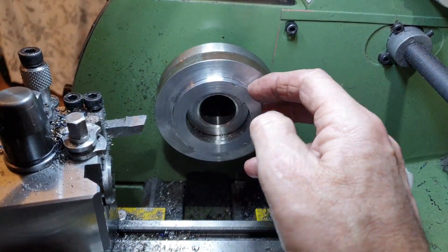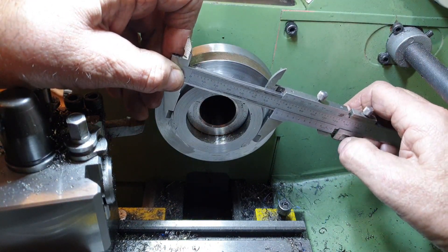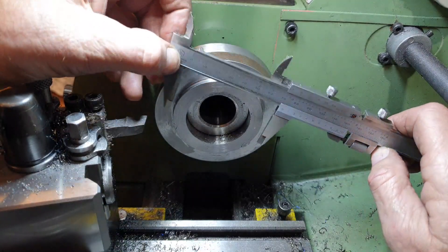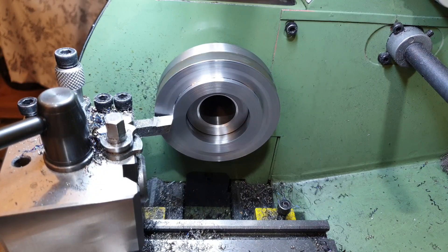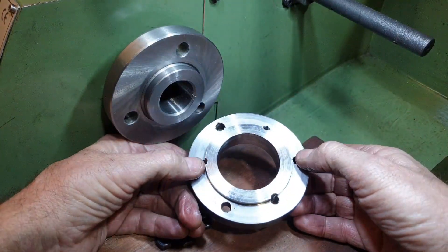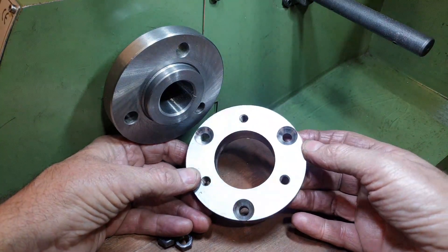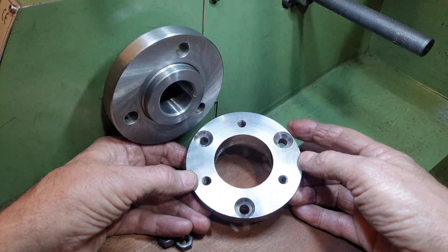On to the final stages now. The register needs to be 72mm. Unfortunately my micrometer won't fit as the register's not deep enough, so on the vernier I'm reading 72.4mm. I've drilled the three holes for the bolts that will be used to fit the collet chuck to the back plate — M8. I've actually gone with countersunk bolts. The option would have been Allen cap, but I think I'll get a little bit more clearance with the countersunk bolts.